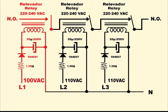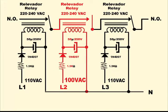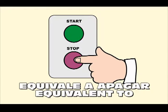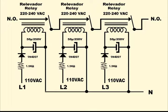If the power line voltage in one or more phases drops, say to about 100 volts, the corresponding relay is deactivated and its contacts open, turning off the push-button station as if someone had pressed the stop button. Since the normally open contacts in the three relays are in series, one relay deactivated is all it takes to turn the motor off.